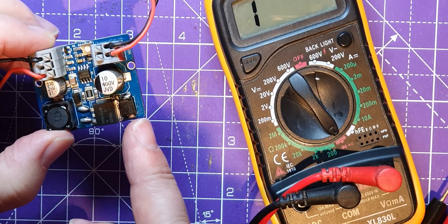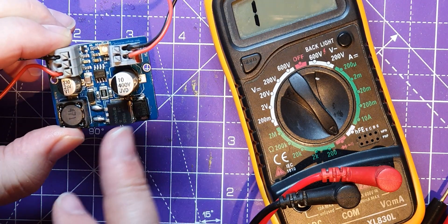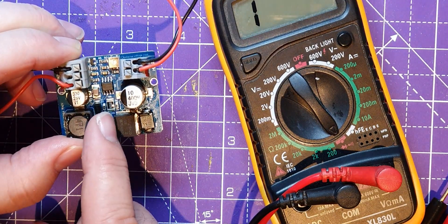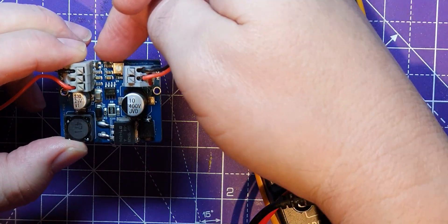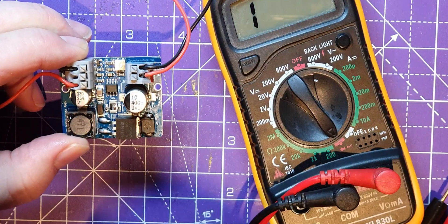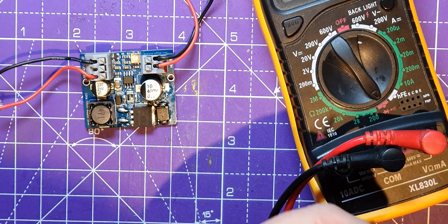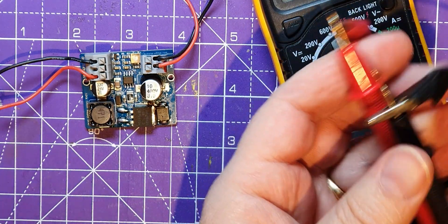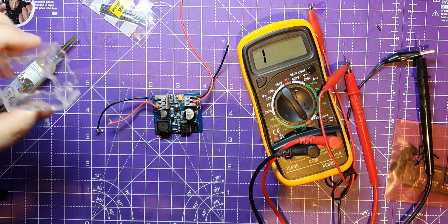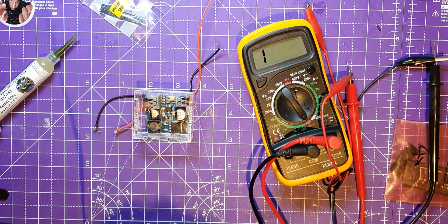I've put the MOSFET back on and the diode back on - not very well, I was trying to use hot air for that top one. But more importantly I was able to use hot air to swap out the controller chip. I've still got some spares to change that one at the end, but I did the ones in the middle first because I'm more likely to bust something else when replacing it. Let's try it. I'll connect my multimeter to the output with crocodile clips. Let me just put that over it so I don't get into the situation that started this video.